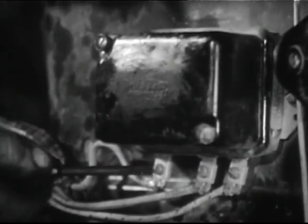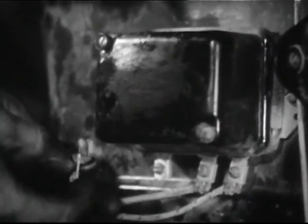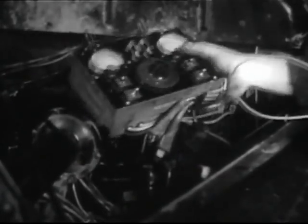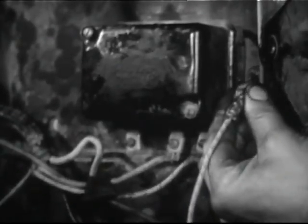You are now ready to conduct a series of tests on the voltage regulator. To test the cutout, disconnect the battery lead wire and, since it carries live current, wrap the end with tape. Next, hook up a voltmeter between the regulator terminal and hold-down screw.